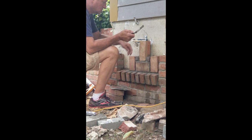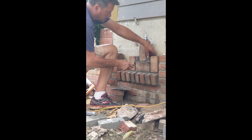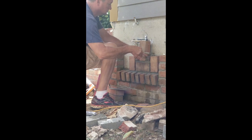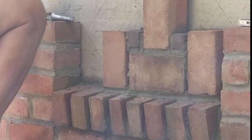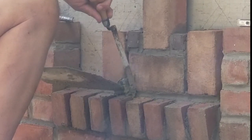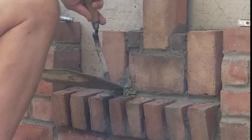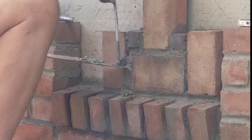I'm setting all these bricks because I'm not sure how it's going to go, and I want to make sure I don't go too fast and make mistakes. Setting the brick and then doing the joints is tedious, but I opted for that for these more technically special joints. Pushing mortar in until it fills the whole cavity, then smoothing it a little bit. Later I'll put the striking tool to it and get that concave finish.